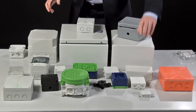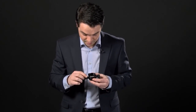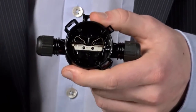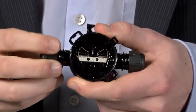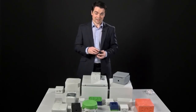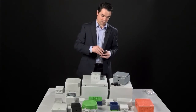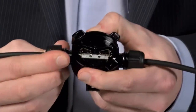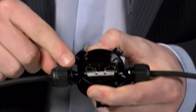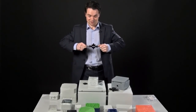Some enclosures have been designed with a specific application in mind, which means that they may come pre-installed. This one — a PV enclosure, specifically for photovoltaics and making a connection — has a special connector inside here, which allows the wire to be pushed in through this cable gland and then clamped down with the wire, and all you need is a screwdriver. Here's one I prepared earlier: as you can see, the wire goes through the cable gland, forms an IP68 seal into here, and the cable retention on that is pretty solid.